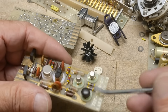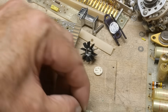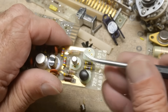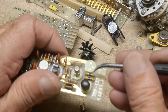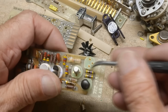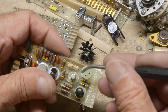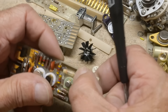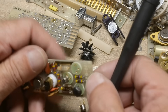The other interesting thing about this board — oh, here are those standoff things again. No, these aren't standoffs, these are sockets: little sockets made of little PC board. It's FR4 type of material with three little inserts — little pin socket inserts — that this little PC board holds. Then you solder it into the board. So instead of soldering three individual things in there, you have this little piece of FR4 that would go in there for you. Makes it easier to solder.